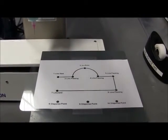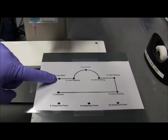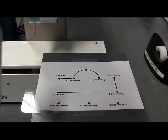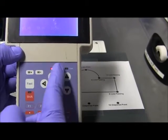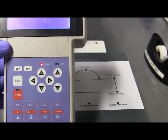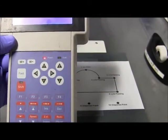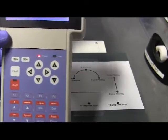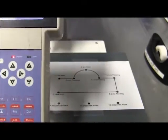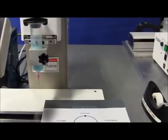The main thing with all robots is to program them: you have to go to a position, and then you have to define that position. So let's say you want to go here and define this as a start of the line. With the 4000 series teach pendant, this is where the movement keys are. For each series robot, the movement keys are located in different sections of the teach pendant, but they are always present. So the first thing you need to do is locate where the movement keys are, and once you locate them, you will be able to move the robot head.